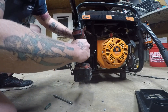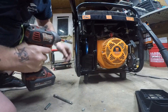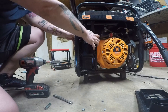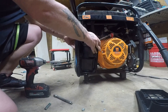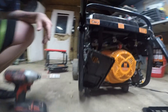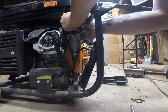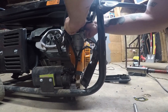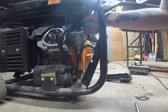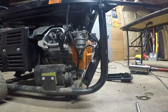Once you get those 8 millimeters off, there are technically three 10 millimeters — there's one in the back that's a pain to get on all these generators, but we're going to ignore that. Once we get those off, just pull it and bend it away — there we go, we got the gasket. From here we can slightly pull out the carburetor, move the throttle, pull out the spring, and push that aside. I just realized this is dual fuel too.